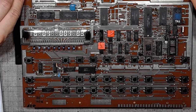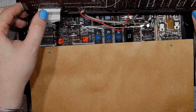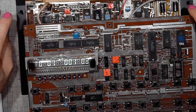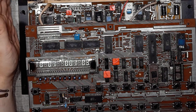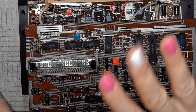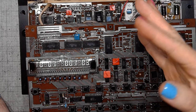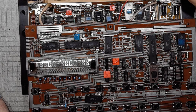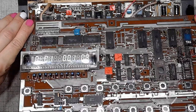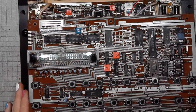but there was a slight problem located here. See, the way the connector was soldered, or to be precise, the insulating shim underneath the connector, it had holes in it. And some of the contacts made a short circuit to the positive pole of the battery, shorting it out. So that killed the batteries, and that made battery backup very unreliable. And I desoldered the connector, changed the insulating shim, reassembled it, and now it's working.